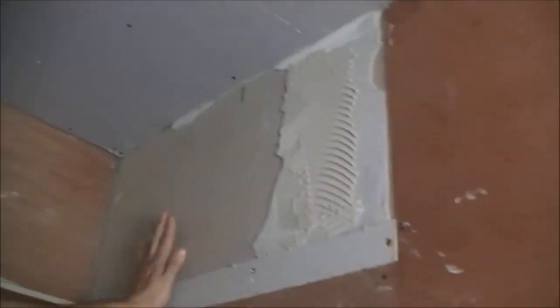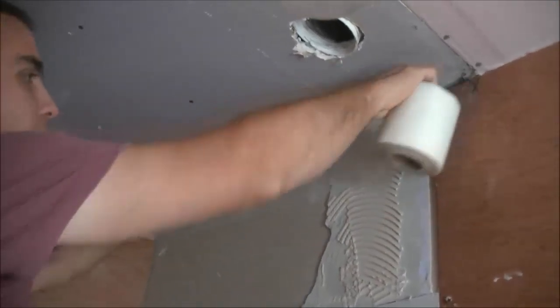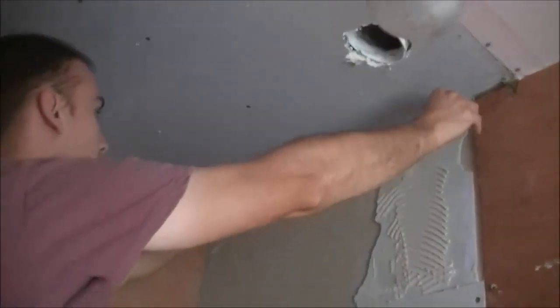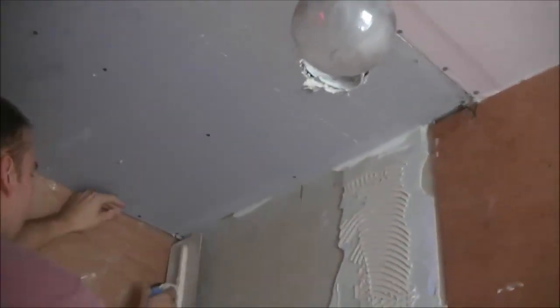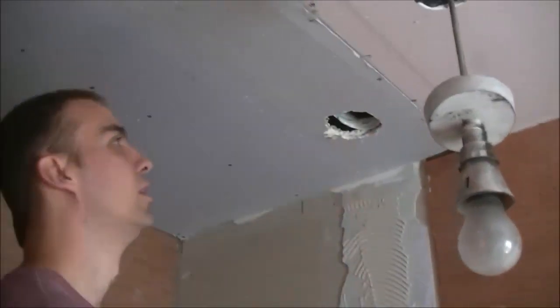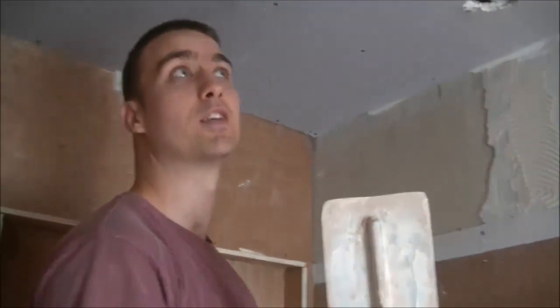You need to screw that in a bit more, and this will need a bit of filling out for the tiles. You don't need to measure it with a measuring tape — just fire it up. So that's actually the ceiling prepped, and I can go ahead and plaster. What I usually do is coat all my scrims first, and then coat the whole ceiling — two coats. Thanks for watching.